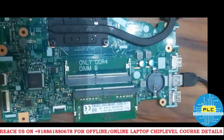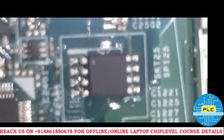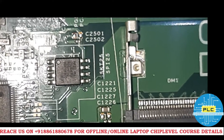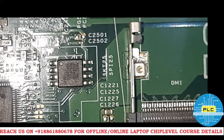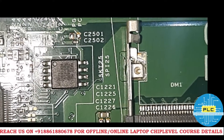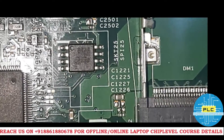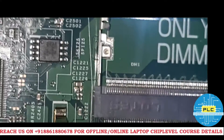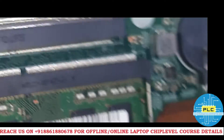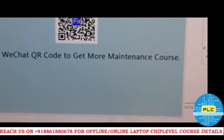Here is the AMD board, and I'll show you what the chip name is. The chip name is MX25U6435F. If you open it in the software, we'll check what it shows. I'm opening the software now.